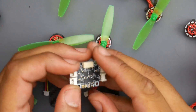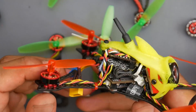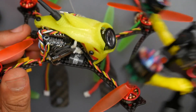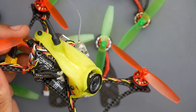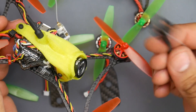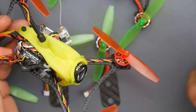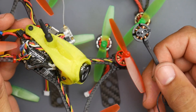When I was testing today, I used a 20x20 ESC and I actually did burn the motor on 3S. So these are not really 3S compatible — obviously with the KV, they're not really 3S compatible. The iFlight ESC was giving the full possibly eight amps to the 11,000 KV motor, or 10,000 KV motor, and that's why I burned the motor. The iFlight ESC is actually a really great ESC because it does give all the current you want, even though it might be too much and you might end up burning a motor. So don't use anything that's 10,000 KV on 3S — there's a high probability you'll burn it.